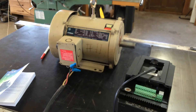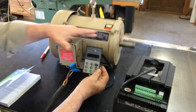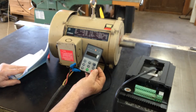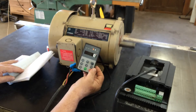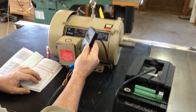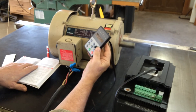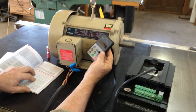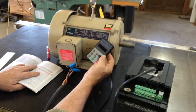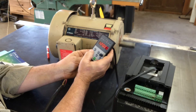I was able to adjust all of the parameter motor settings. What's fantastic about this drive is it has a static auto-tuning. It actually configures the motor specifically — you have to enter a number of values. And if you get one of these drives, I'll send you a private video of which parameters are important and how to enter them. To do a static auto-tuning, which allows the VFD to read what the motor is doing and compensate in vector mode to keep rotational speed correct.